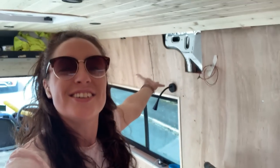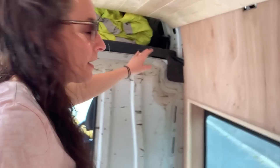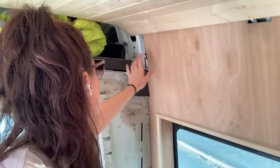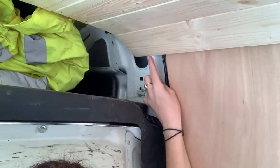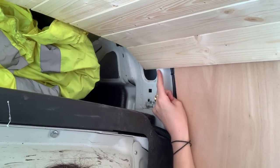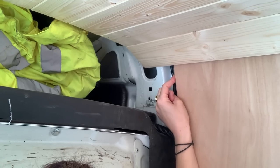Problems and challenges galore with this roof. I know it's my own fault because I want it rounded, but it's a bit difficult. I've come across another issue with this end piece of metal — the tongue of this piece above is resting directly on the metal, so we can't get the groove behind it to connect in, which won't allow us to slide the next layer on. So what Dad is going to do is something new again — he's going to cut off the tongue part of the tongue and groove so we can slide it in without having to undo our work.